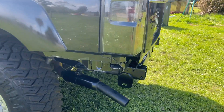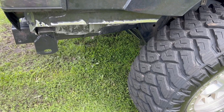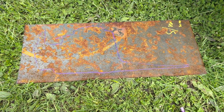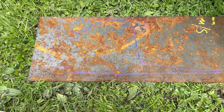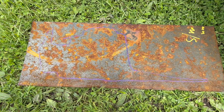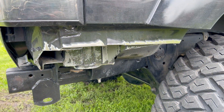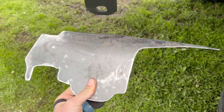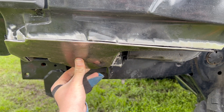I'm getting ready to cut these plates now. I've cut a piece a little bit bigger than that section, held it up against the cut, and used a colored pencil to mark it the whole way around. I'll cut some of it with the grinder and some with the jigsaw for the weird angles, then sand it back because it's got a bit of rust on it, and then tack and weld it up. This is the piece for the right side — it basically sits up like that roughly.